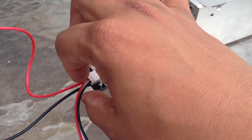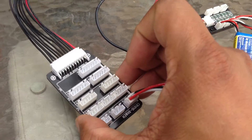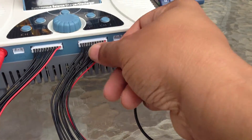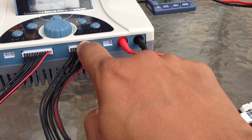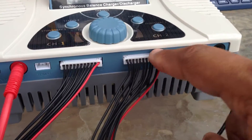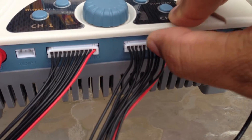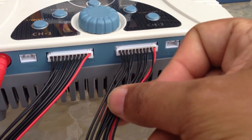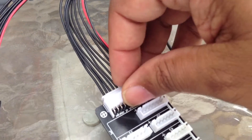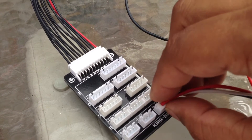Something I do recommend: I've got this 2S parallel board, and I recommend always using the breakout board. It's simply because up here where you connect your balance leads, you don't want to be jabbing a 6-pin connector into where it typically connects. Go ahead and use the breakout so you're not bending any pins. I've got my balance lead coming directly into the balance lead port on the board, and then plugged into the 2S slot.